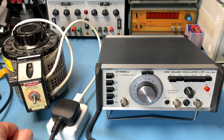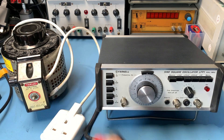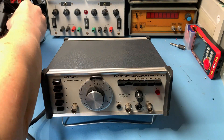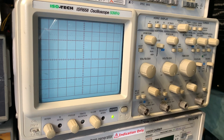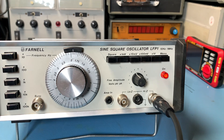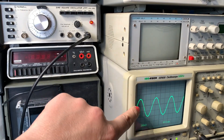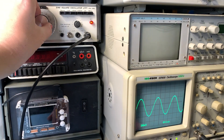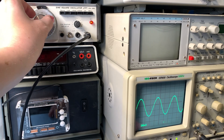Okay, so it's been running on 220 volts for a little while now. So let's turn off the variac. I've done that over a period of time gradually — I'm happy enough with that. Now I'm going to plug it in directly. Power up. Looking good. Now we want to check if we get a signal. I've moved the Farnell up on top of my Solartron meter here just so you can see the oscillator and the scope at the same time. It's a really nice clean sine wave and it's really stable. The geared frequency control is a joy to use — very precise.